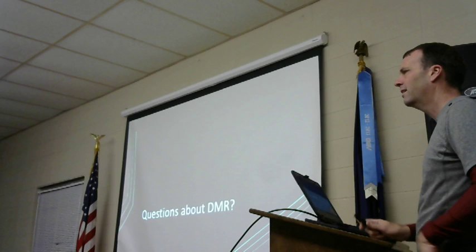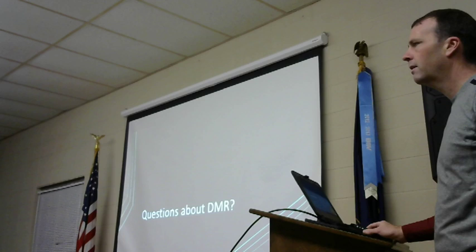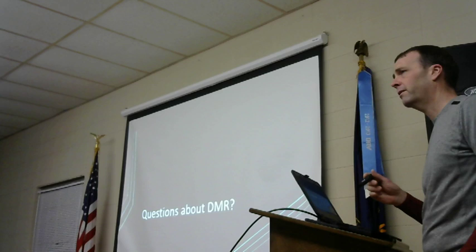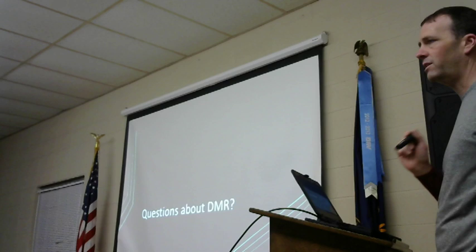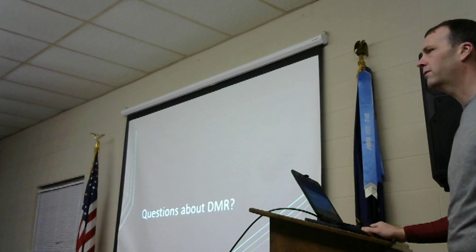Now, these radios have the ability to do it, it's kind of like roaming. Do you recommend it? So for roaming, the new AnyTones are the only other radio on the market that will do roaming besides Motorola. And the only repeaters that do roaming are the Motorola repeaters. We have that shut off because it beacons every so often, and it's just wear and tear on the repeater. And if someone's listening on a scanner, this is how we found out about it, it's annoying. There are scanners that will listen to DMR, and there are actually people who use them to do that.